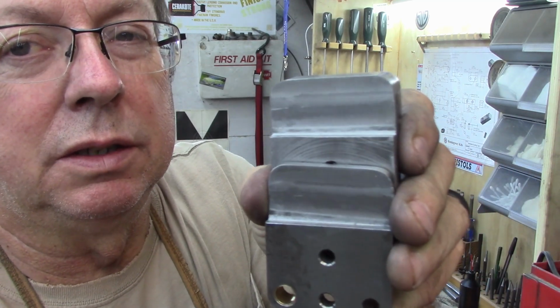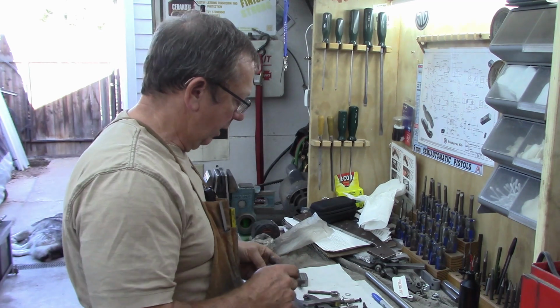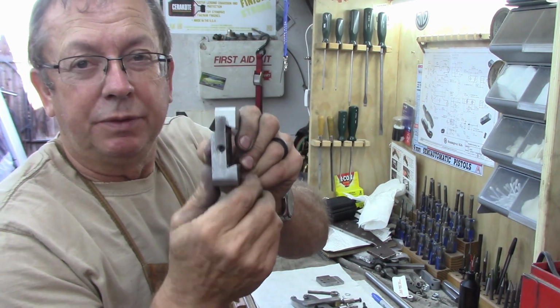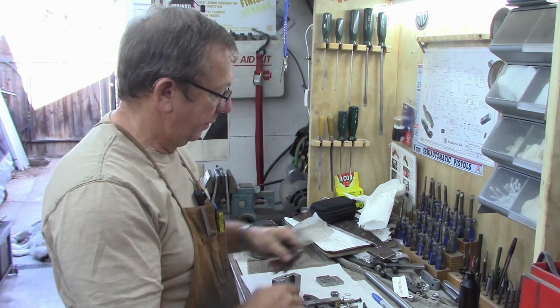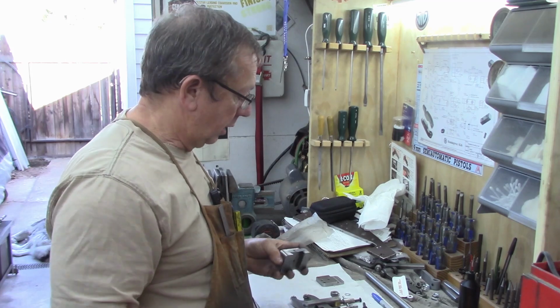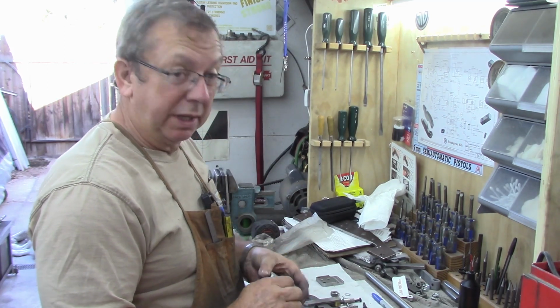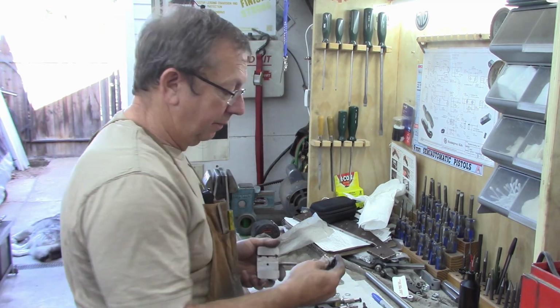If I can get it there so you can see it. Anyway, that's what we did there for an upper knob, and then I drilled and tapped it 5/16-18 for my elevation adjustment on the quick change tool post. Cut me a piece of ready rod that just threads in there, and we'll make adjustments to the length on this once it's final assembled or once we test it.